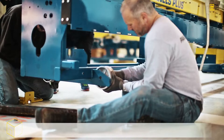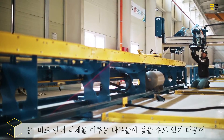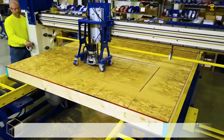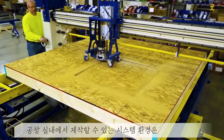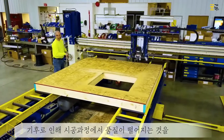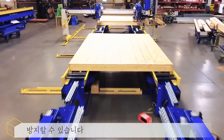You're building indoors in a controlled environment, so you can have everything ready. Like the houses back here — they have the Tyvek already wrapped around them, so they're already ready for the weather when they go outside. Rather than sitting out there, if they just get framed one day and it rains, all the studs are going to get wet and you have the moisture problem already in the wood.